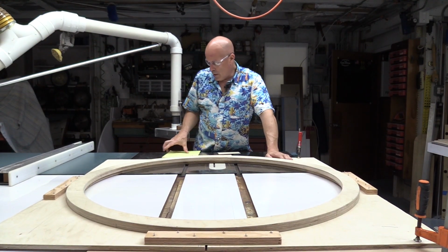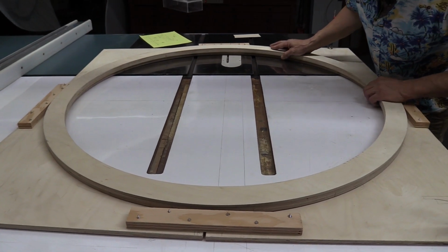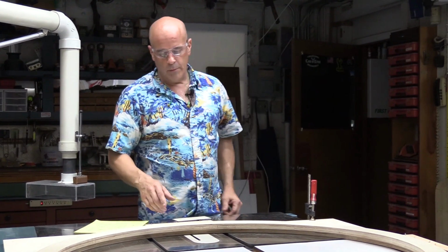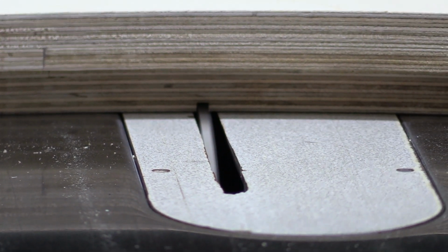So in order to create this radius that we have in our drawing here, we've made a jig, which is the exterior components of what we cut the discs out of. So saved plywood and made it simple to do. So basically we're setting over our table saw blade. As you lift up the blade, it's going to give us a 10-inch radius, blade being 10 inches.